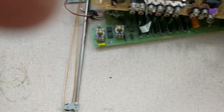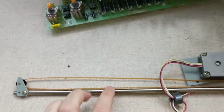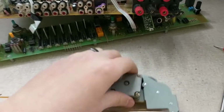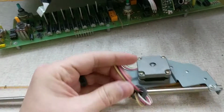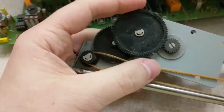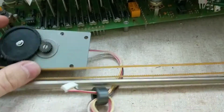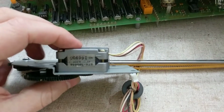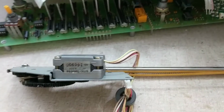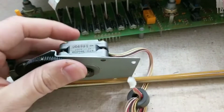And let's move on to another board. Now, if you have just a normal printer, usually this is the valuable thing to get out of it. What this guy is right here is a little 4-wire, 5-wire stepper motor. You can see on the other side, the stepper motor drives the gears, the gears drive the belt, and usually you'll have your print head on here. So we can actually take this stepper motor off and use our own microcontroller and use it to move something else. Whenever you're scavenging from just an inkjet printer, this is usually the thing you go for.